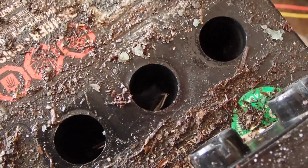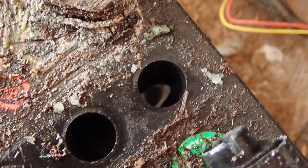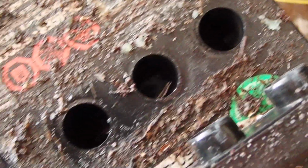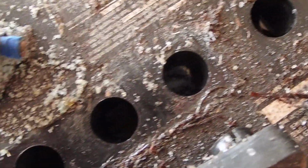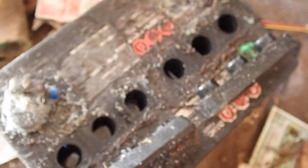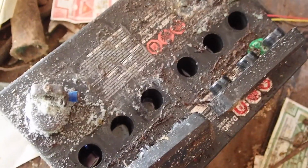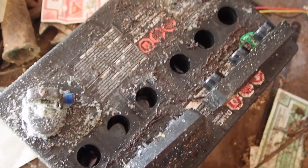And you'll recognize it when you see it. It's kind of cardboard-looking plates usually, or just a straight plate in there, depending on the type of battery. So what you want to do is just top these off with your distilled water, put the lids back on, and that's your maintenance done. So I'll just add a little bit here, and we'll put the caps back on.